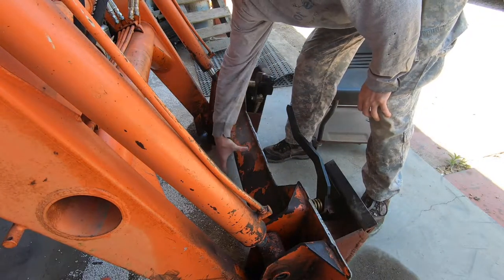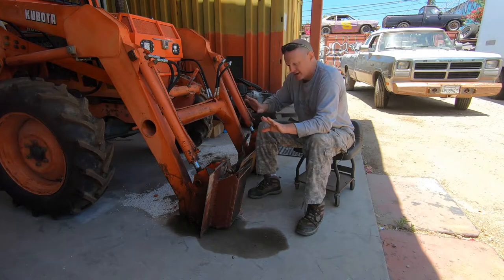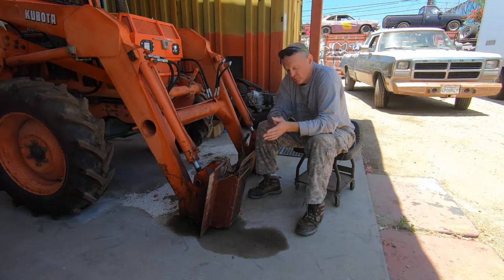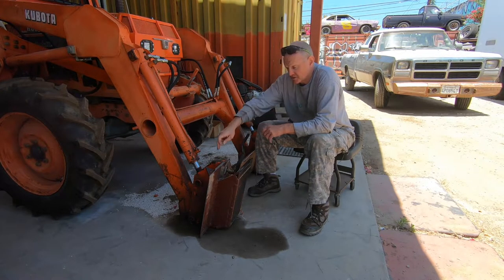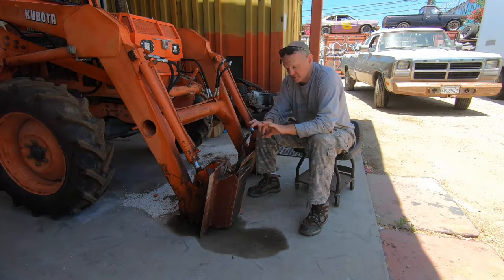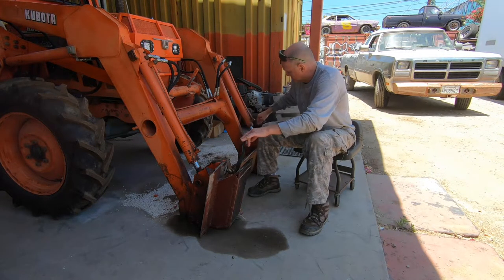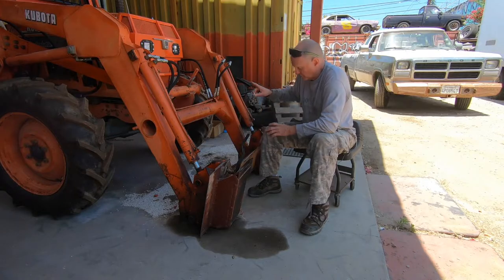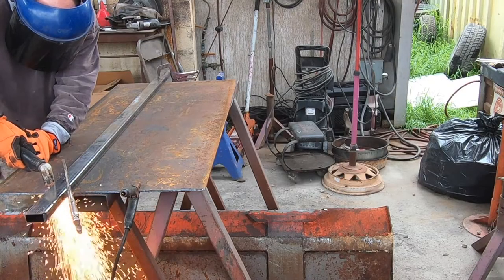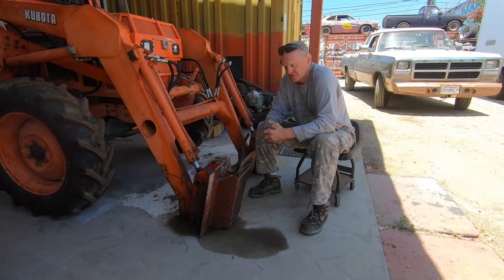On the back of the bucket, there's a large metal brace that prevents the two brackets from being able to twist. One of the problems I see with a lot of newer machines — even ones that come with a quick release now — is that what's holding these two mounting points together is just one small round bar. Over time, with the right amount of pressure, that bar twists and these connection points are no longer in alignment. It was also a lot less welding — one straight big cut, a big panel that fit in there, and then I had to weld on my attachment points. Not particularly difficult, just time consuming, but definitely less work than cutting out the back of the bucket.